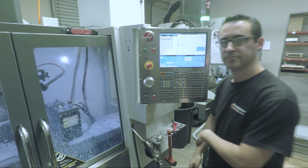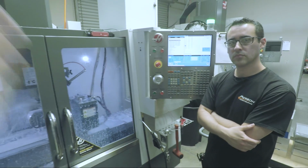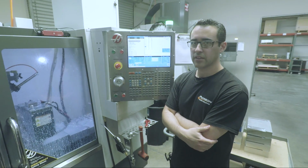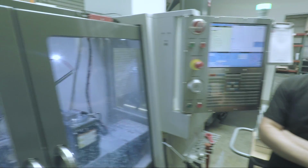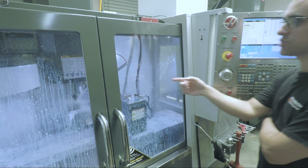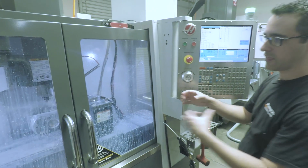That's a great tip, folks, for running pipe taps in Fusion: if you've got a 3D model taper, you can use a 3D adaptive toolpath. It's going to leave some stair steps, but the tap can power through that. It'll clear it out. Yep. Awesome. And it looks like it's doing a little rest machining after that last part and finishing the pocket.